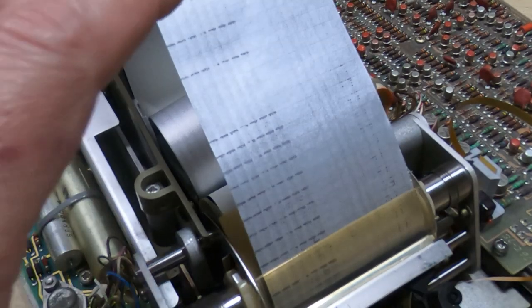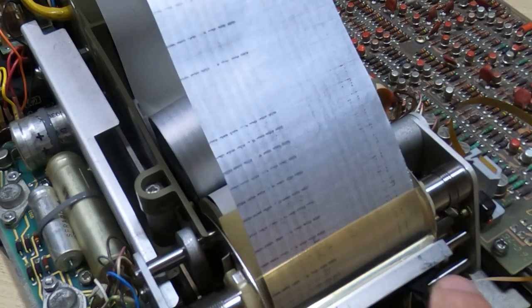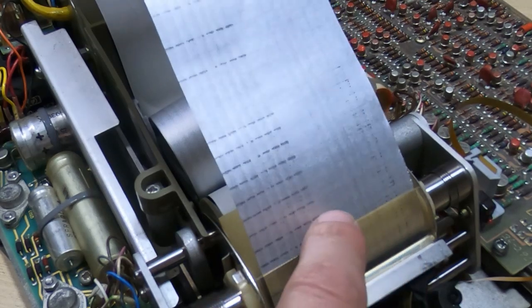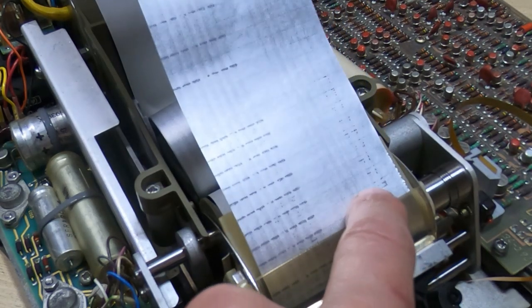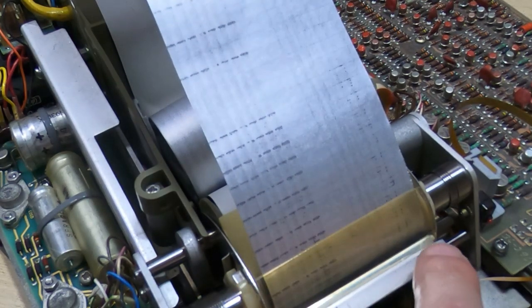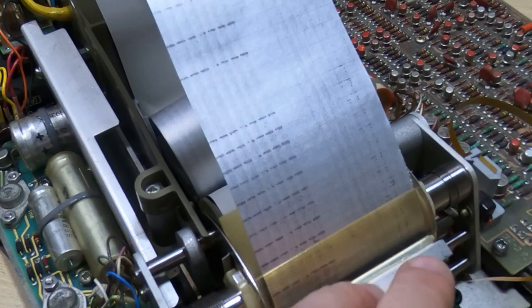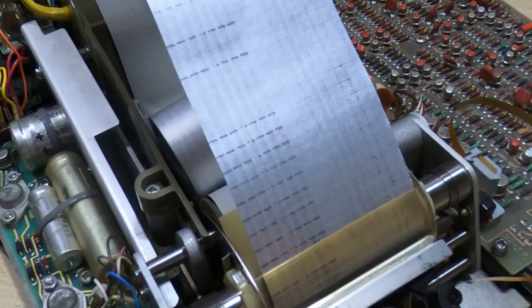Okay, obviously I'm not going to keep you waiting until the next video. I have adjusted the printhead very slightly. I've moved the fingers out about another 0.5 millimeter and it is now starting to show proper characters. Not particularly clear yet. I suspect there's a lot of pitting and oxidation on the end of the fingers. They were fairly blackened when I was inspecting them under the microscope, but I didn't want to start messing with them at that point.